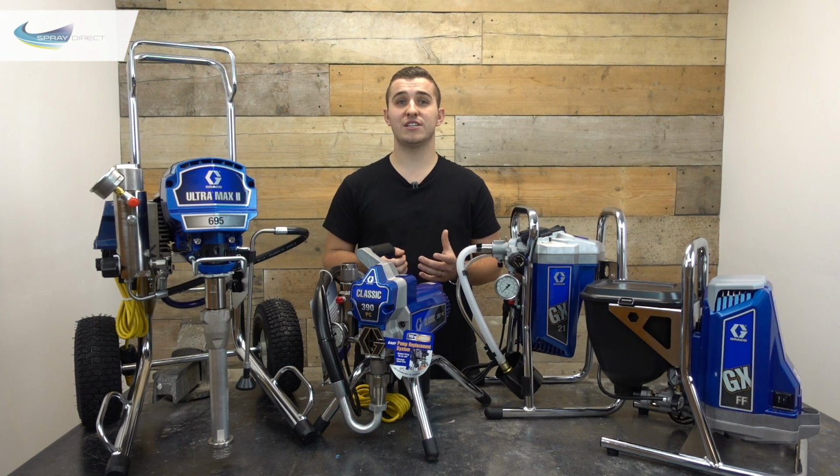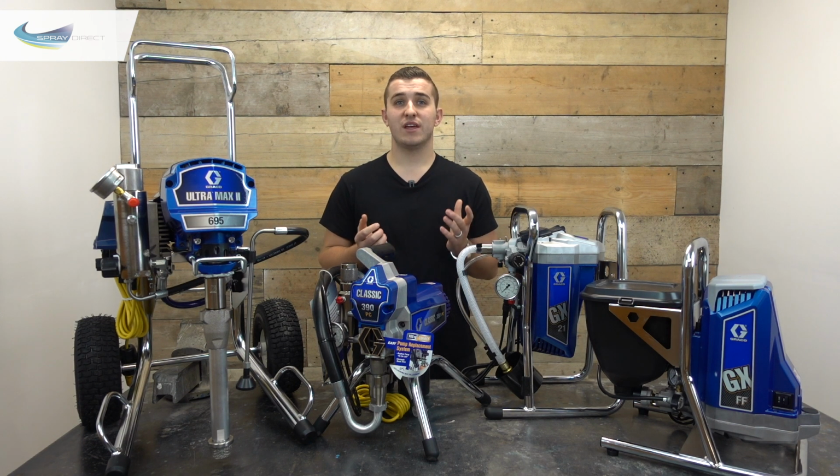But most of the larger airless units are only available in 110 volt in the UK, and if you're looking at anything from the Graco 190 and up, you're going to have to go for 110 volt and use a transformer. So which one should you go for? This is entirely dependent on the type of work you want to be doing.